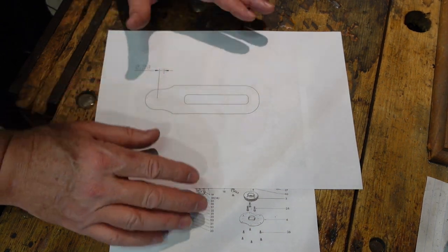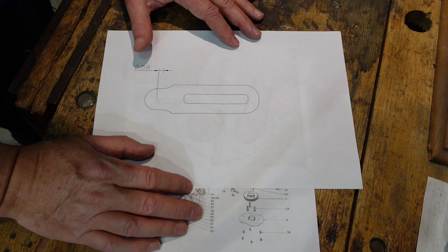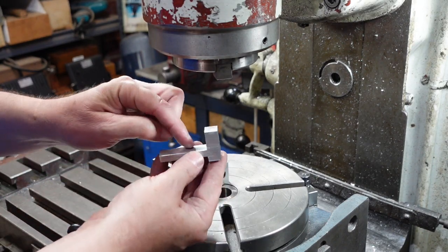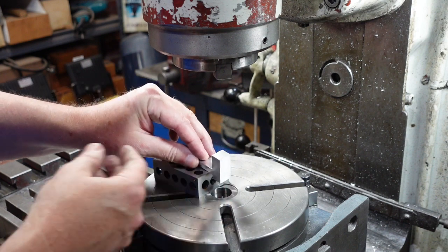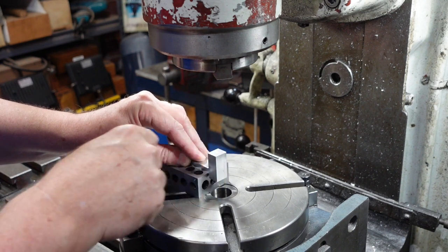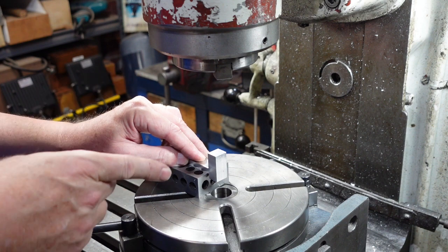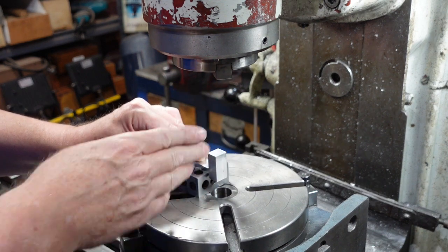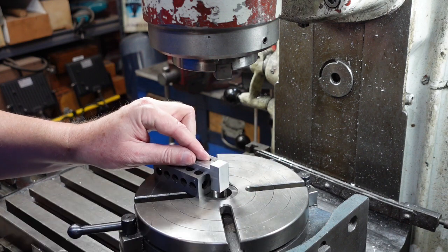This is really a check. This is six millimeters, but I originally started with something like 12, which would be three millimeters either side - that makes it remarkably weak. So I took that out to 16. That's the problem with scaling off small drawings - if a line is halfway between two marks on the ruler, which way is it? I've pre-shaped my block - that's going to be the tab which does the work. I'll set that up on the rotary table, use my microscope to get the crosshair centered, then put a radius on it.